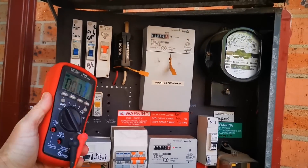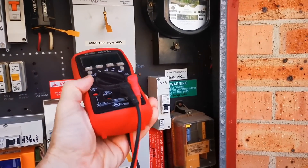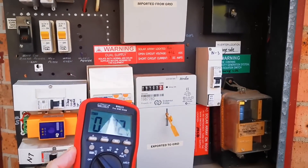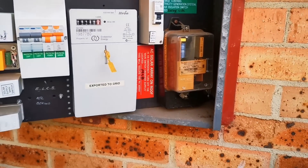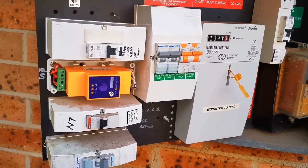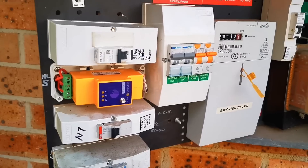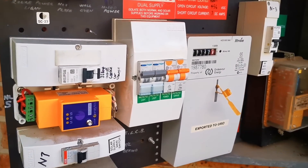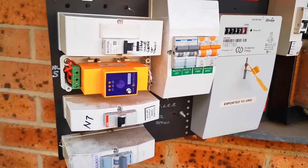Here's where one of those magnetic hanger things would have come in handy. I've got the original red meter — there's just nowhere to conveniently put it. You can't get in there with a voltage detection stick; the one I've got is just too sensitive. This whole box is spewing everything out and you can't detect an individual wire, so you've got to actually touch-probe it.